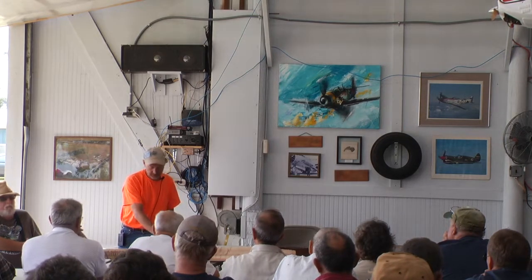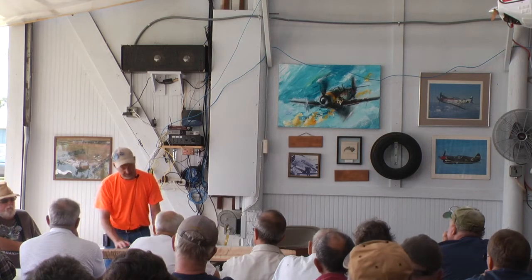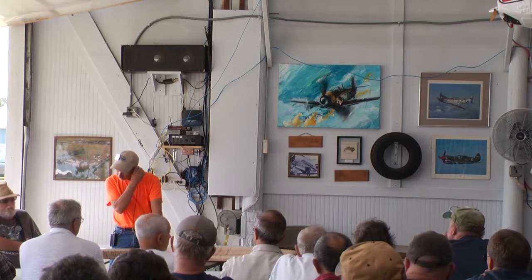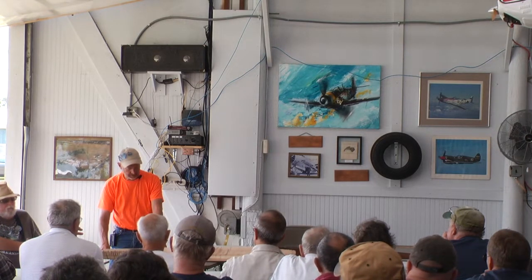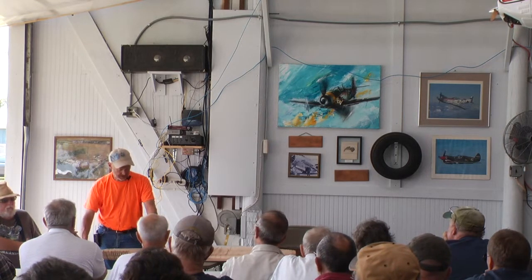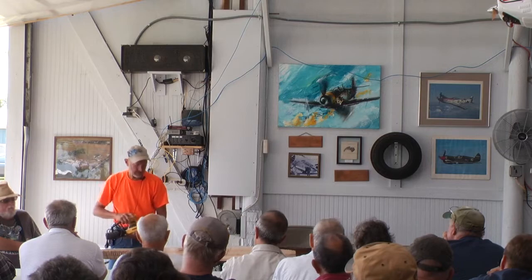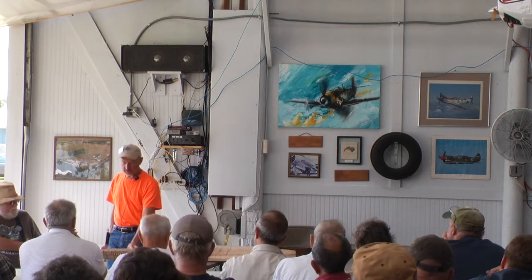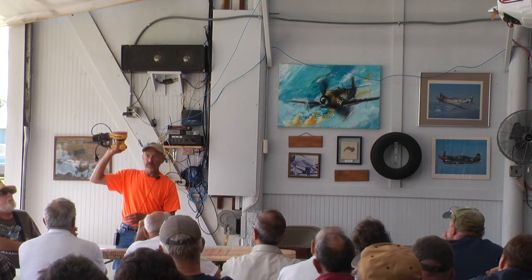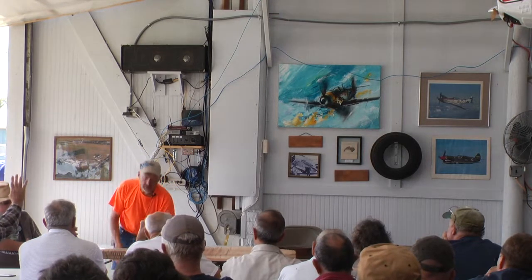So at that point, he would remove all these cut marks on there and get this blade fairly close. And he actually completed the back of this first blade using an orbital sander for the last step. Once he got most of the material off with that 7-inch disc sander, he went after it with a sander like this, with like a 150 grit paper. Finish sanded it.